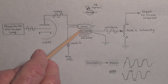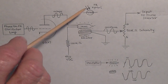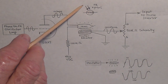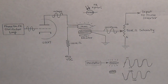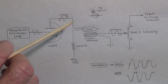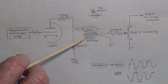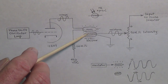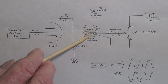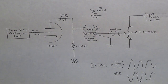We have very closely coupled here to the neon bulb a photoresistor. This is its classic symbol — a little resistor with a circle around it and light shining down on it. Most photoresistors are made of a substance called cadmium sulfide, which because of its molecular structure has a varying resistance depending on whether or not light is shining on it. Thus the name photoresistor.